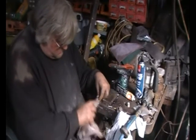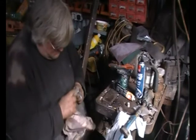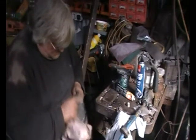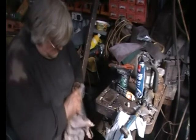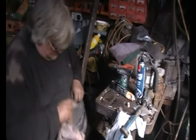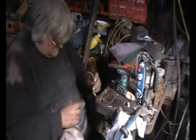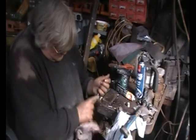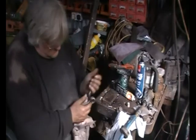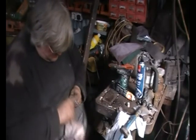After about five minutes it came out of the tank. The bright finish had gone and was replaced with a dull gray finish, a bit like the zinc plating I do in the zinc plating bath. That usually points to too high a current and the deposit going on too quick, but as I say we shall keep going. Here you can see me polishing it with Solvol.